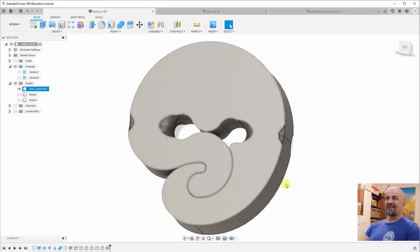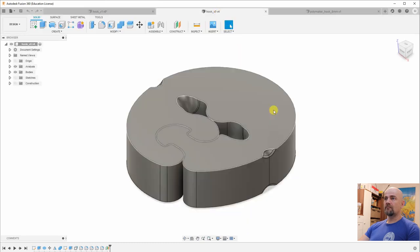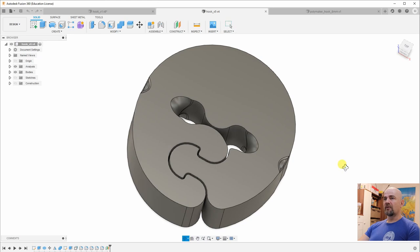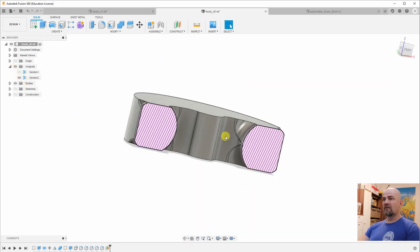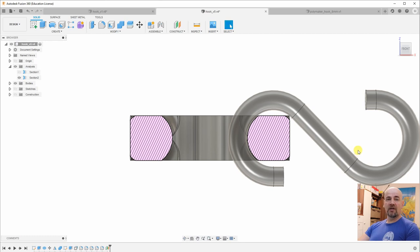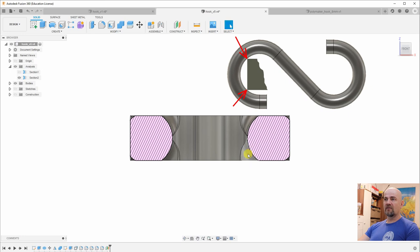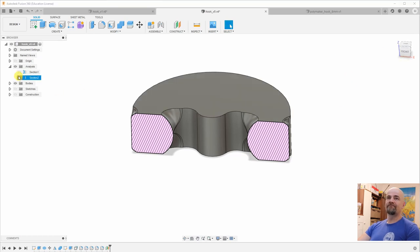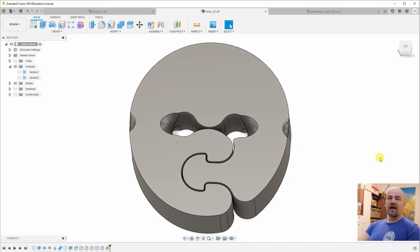Because I wasn't fully sure, I created a second version with the locking mechanism on two sides. It's very important that these three elements have maximum equal thickness to avoid weak points. I also added a rounded surface here because I want the hook to align on the surface over a very large contact area. If it were just a flat surface, the hook would align on only two points, and by spreading the load over a bigger surface, the plastic material should experience less stress.